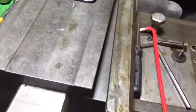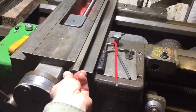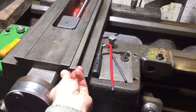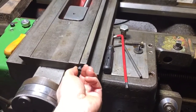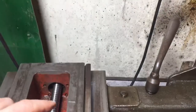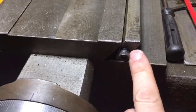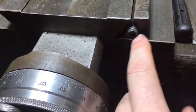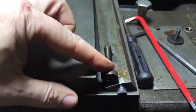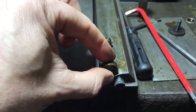The other part is this long tapered sword-looking thing, which is designed to take up the slack — the further you push it in, the tighter things get. The snag is that it rode up on the screw at this end and broke the end off. So what I've done is make a little tab that goes on the end here so the screw won't go too far in. The screw will sit on here, push it in, and a little plate will go on the end so the screw adjusts but holds this tapered slack adjuster in place.